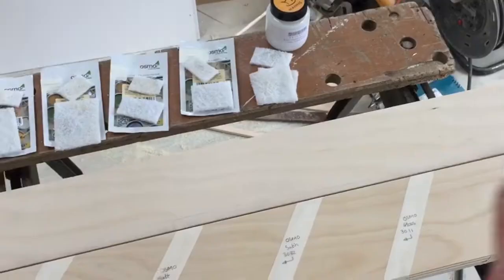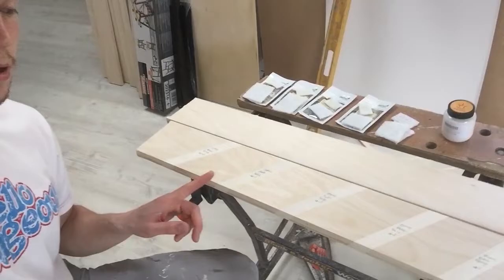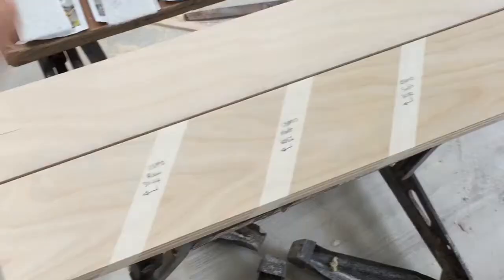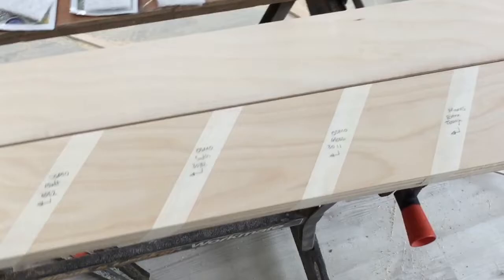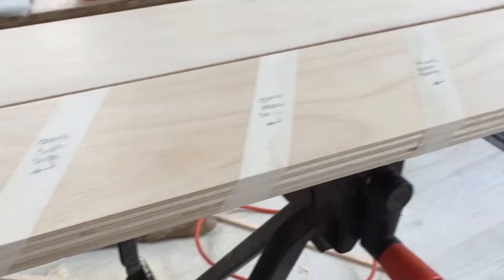This will need 24 hours to cure, but because it's warm in here it's dried much faster than expected — about six hours. Looking at the five samples, they're a little lighter than when first applied. From left to right: raw Osmo, matte, satin, gloss, and the Manns extra tough interior varnish. The raw and interior varnish still look most similar to the original. My personal favorite is still the satin, so I'm going to apply a second layer to all of them and make my final decision.